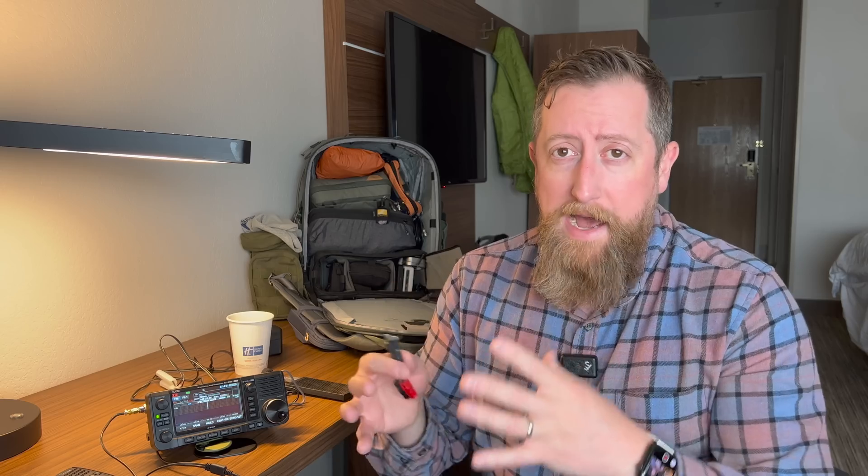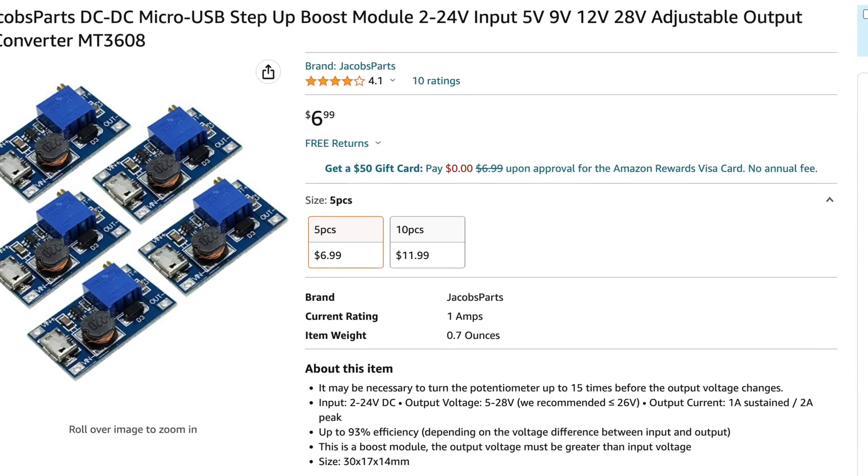This is an untested unit for me. Hopefully if you have power delivery type devices or charging capabilities, this should work just fine — the reviews on Amazon are pretty good. It'll take the USB output voltage, which is about 4.5 volts in a lot of cases, and step it up all the way to about 24 volts. We only need to get it into around 12 to 13.8 volts for it to run a radio like the 705 or a QRP radio. These also work really well for charging your handhelds in the field. You can get these on Amazon — I got a pack of six — along with some heat shrink tube, power pole connectors, and a bit of wire.